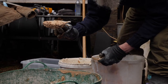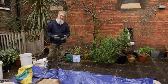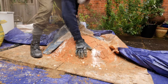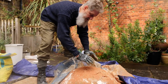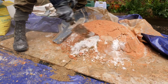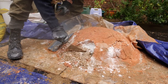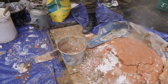We're returning now to the hot lime mix done an hour earlier — normally I'd leave it overnight, mix it one day and knock it up the next, then run it through a sieve. Let's have a look at how this has performed in the last hour. It's extremely hot and doing nicely — it may need a little more time. You can see by the cracking that the lime inside is expanding, and all that granular material is now turning to powder. We'll mix up the powder material with the lime and aggregate — that's what we make our mortar from.